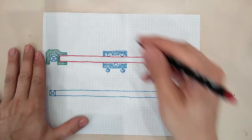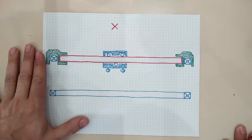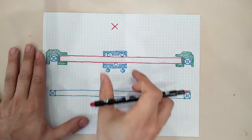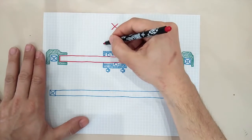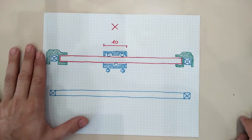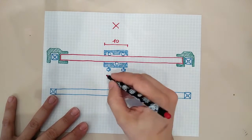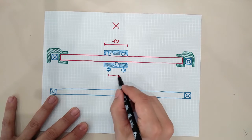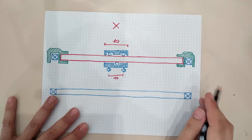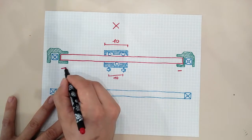So the order in this case will be X, Y, Z. We need to move one meter so we add some centimeters just to be safe. Then we add the sides of the carriage holding the extruders, which we estimate being 10 centimeters wide — we will design it later, for now we just imagine a huge box. Then we add the spacing between both extruders, which in the worst case scenario will be the same size as the carriage. Finally we add some length that will go straight inside the Y carriages — 3 centimeters per side will be ok.